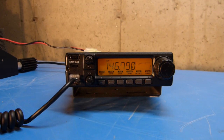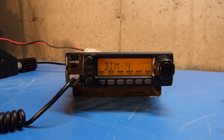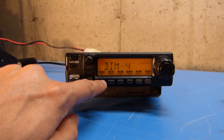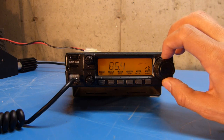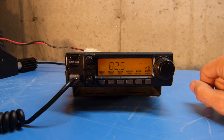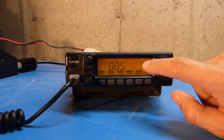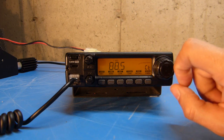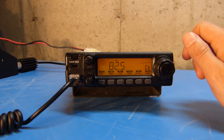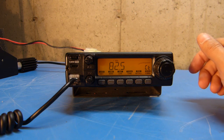The next thing I'm going to program is the CTCSS or PL tone for this particular repeater. To achieve that, I'm going to push the set button once to get into setup mode, then press it a number of times until I get to RT, which is the repeater tone, and use the tuning knob to change it to 82.5. Pushing set again changes to CT, the tone squelch, where the squelch won't open unless the radio is receiving that tone. I'm going to set it to 82.5 as well, just in case I want to use that option in the future.